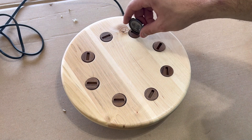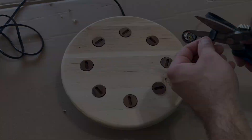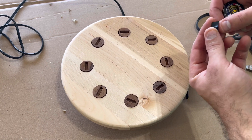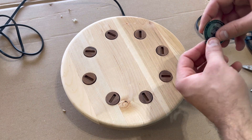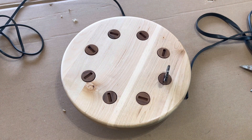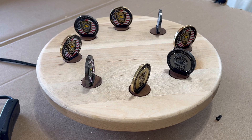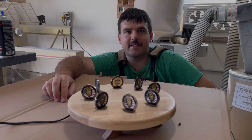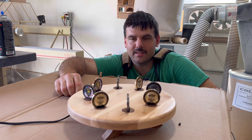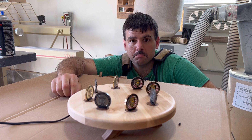Now that everything is finally assembled, I can show you how I fixed my coin slot issue. I use this rubber U-channel from McMaster-Carr and cut small chunks of it that fit into my coin slots. I then insert this rubber U-channel around the coins and insert them into the slots. This not only holds thin coins because of the friction, but it allows enough room for thicker coins because the rubber can move a little bit. It's not going to hold 100% of challenge coins, but it does hold a large variety of them. Once you have all those cut, you're all done. Not a bad project! That's all I got for today — this was a fun project. If you like this project or have any ideas for me, leave me a comment, and as always, hit the subscribe button. See you next time.